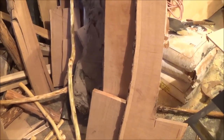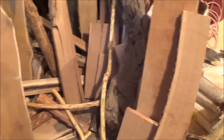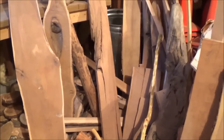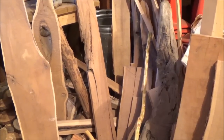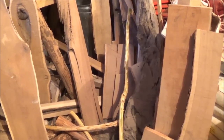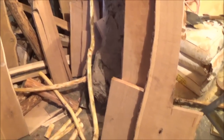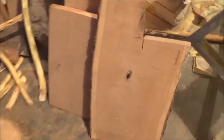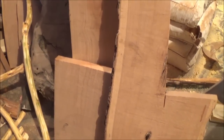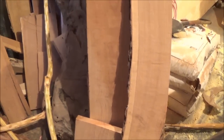These here are some of the boards we're going to be taking the pieces out of. I'm going to need some that are two inches wide, roughly 40 inches tall. My shelves are only going to be able to be 14 and a half inches wide, and we're going to have three-quarter stock on each side, which brings it up to 16. It's all still rough cherry — right now it's about an inch and a quarter thick. We can get this planed down and glued together.